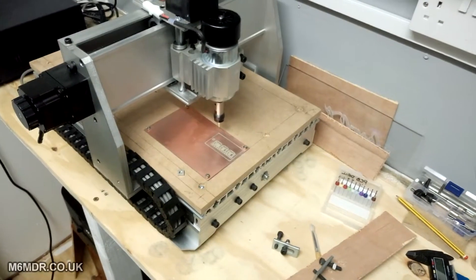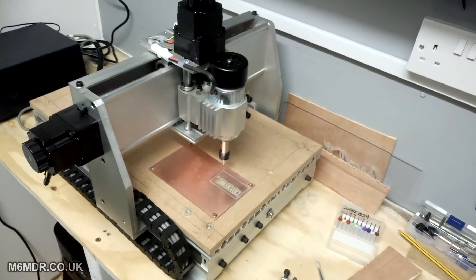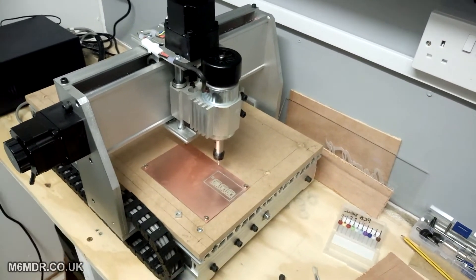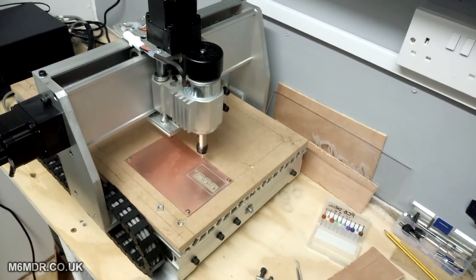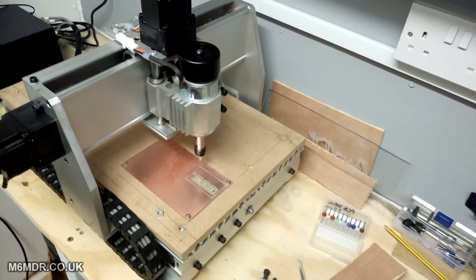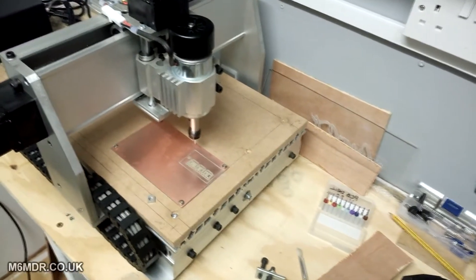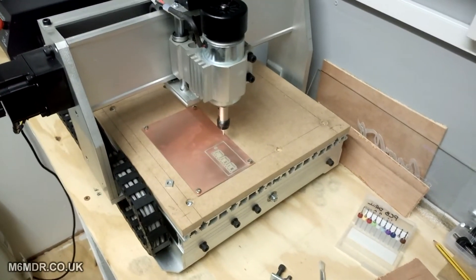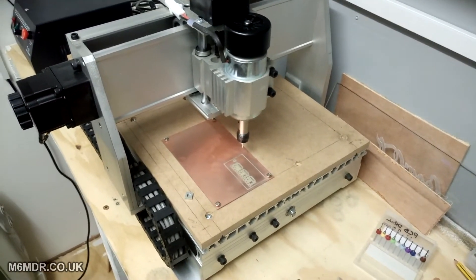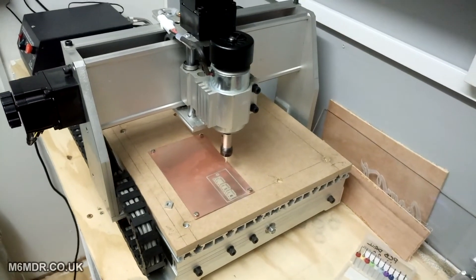It should be even better once I get the spoil board milled down. So if you've got one of these machines, it's well worth putting a spoil board down — one, to save the aluminium bed and preserve it, and two, to get better results. Now all I've got to do is wait for my motor. I've got a few more materials I can practice with — a bit of aluminium I picked up from the scrapyard, and some pine, a long thin plank about four or five inches wide and half to an inch thick, which I'm going to cut into squares and have a mill around with, just to see what results I get using different materials and what the limits are of the machine and its operator. So, thank you for watching and bye for now.